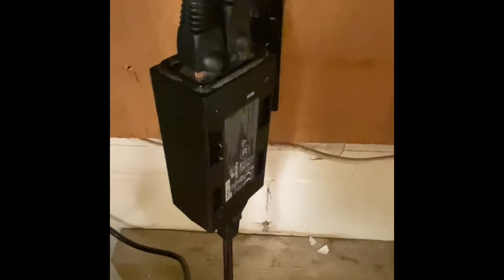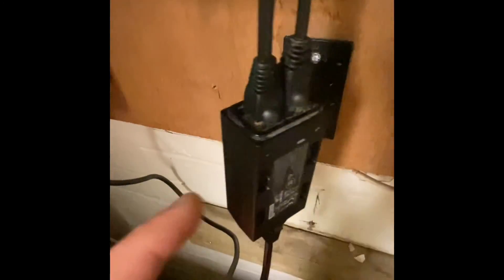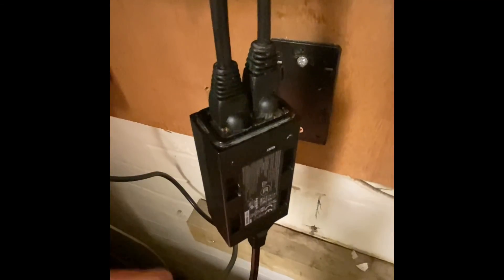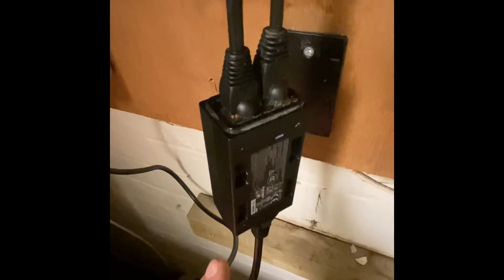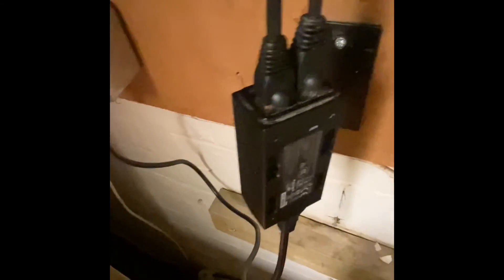A lot of these adapters don't have any exposed metal parts, so visual only. These particular ones do, so they are classed as a class one appliance. Easy to miss that one, but worth looking out for. I've only seen it with Ubiquiti. There are some other unbranded ones — they're like a network port but plugged directly into the mains. Some of them have AC adapters, but this one's plugged directly into 230 volt mains.